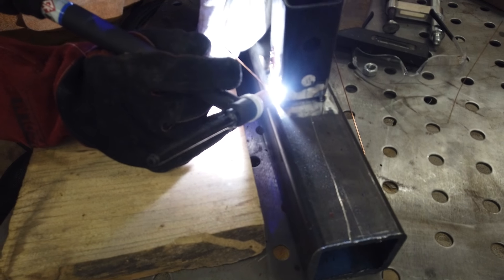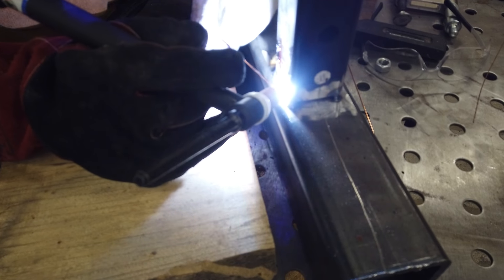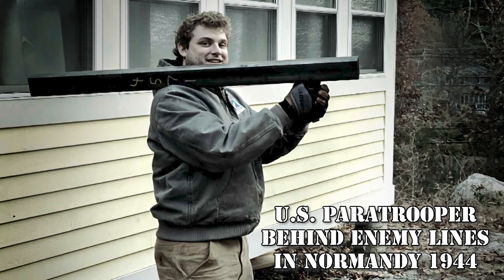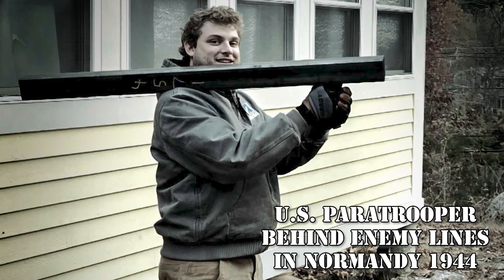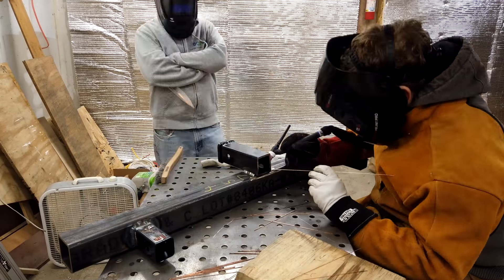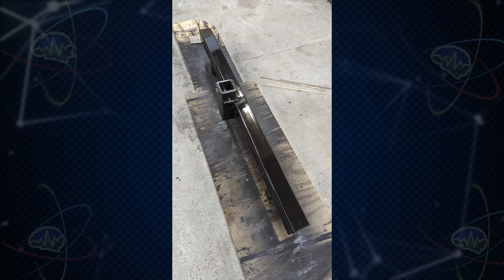Back to the snowplow project. We welded one male hitch post to the steel bar, then brought it out to the truck to mark where the second post should go. Once the two male hitch posts were welded to our three-inch square bar so that they were lined up with the two hitch receivers, we then welded another two-inch hitch receiver to the middle of the bar. We spray-painted the whole bar so it wouldn't rust — and another nice thing about buying the hitch receivers to use as tusks is that they were already painted. This whole bar would receive our snowplow.